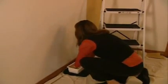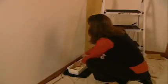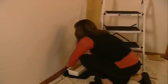The second method for relaxing wallpaper is directly on the wall. Place the loosely rolled paper in the trough and allow it to soak for the required 15 seconds. Draw the paper out slowly. Pat the paper gently, just enough so it stays in position. Now leave it to relax for the magic 3 minutes. While you're waiting, you can prepare the next length. Now let's get back to John, working with the paper I booked earlier.